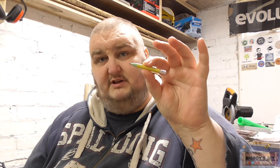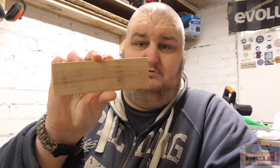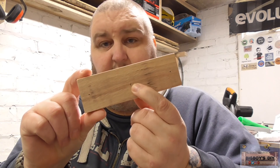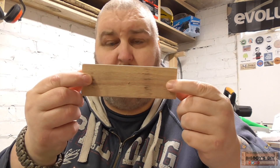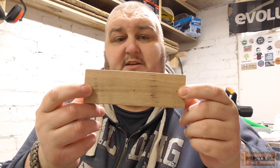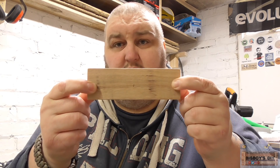I've got a small pencil which is 7.2mm, so I'm going to be using a 7mm drill bit for drilling the centre hole for the pencil. One thing you have got to do with these — this is the 6 inch one, obviously the centre of that is 3 inches — you have to make sure that your holes where your dowels go are exactly equal from your centre point. These are an inch and a half away from the centre point.